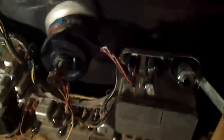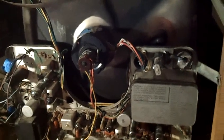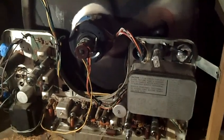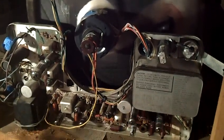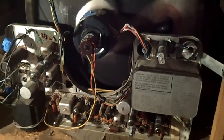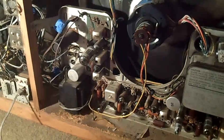Now we're going to move down the center part of the TV. I believe this is the U941 Magnavox chassis, if memory serves me correctly — a black and white chassis, nothing particularly special about it. It's vertically laid out; I think they do that to make it fit more compactly into the cabinet. It does use a power transformer, so it's not a hot chassis — that's a good thing.